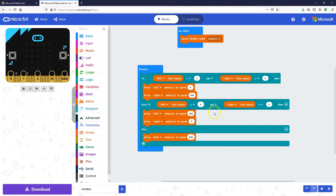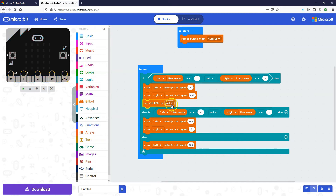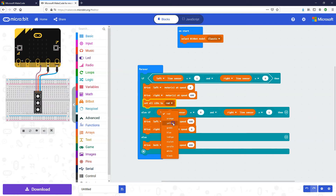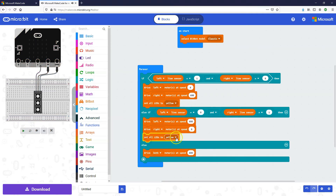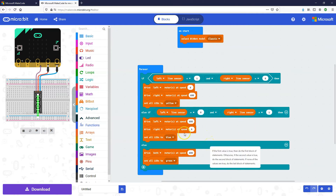That's all the code you need for using the line sensors to drive around the track. We can make it better and tweak it, but first we'll add some LED code — it makes the car look better but also helps us test if the code is correct. When turning left, we'll set all the LEDs to yellow; when turning right, blue; and when going straight, green. Those colors will help us visually confirm the code is getting into the right places.